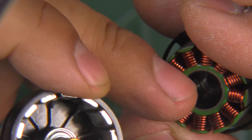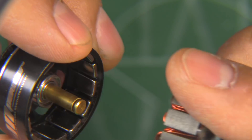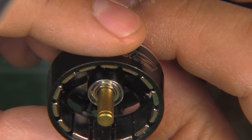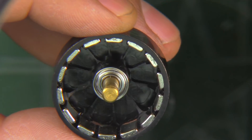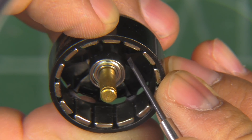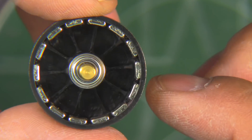Those are 4x9x4 bearings — one came off when I pulled the motor. The shaft actually has really tight tolerances on the bearing, so it fits in quite tight and you have to really pull on it to get it out. There are the magnets — as you can see, they are arc magnets — and they are using vanes on the bell right there. It's actually some kind of active cooling design designed to move air through the stator and keep temps down. Pretty good that they incorporated that feature.